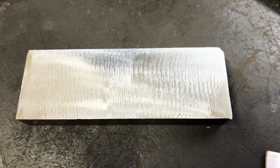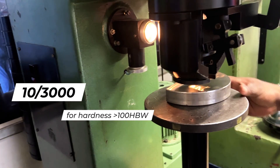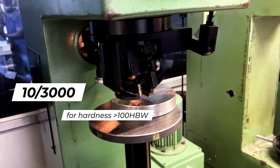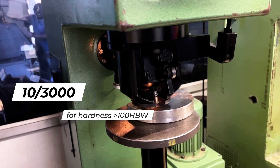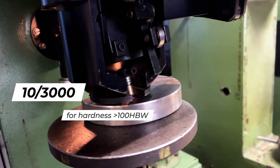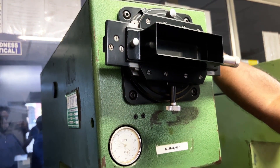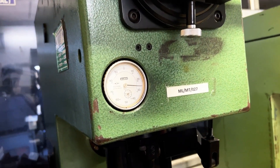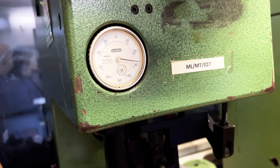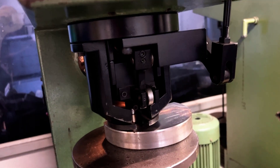The surface is ground to make it flat. We are going to go with a 10/3000 combination, as we know that the hardness of the material is over 100 HBW. If you are unsure about the hardness beforehand, please look up some technical documents related to the grade in hand. Otherwise, wait for the final diameter of the indentation to ensure you are within the test validity conditions.